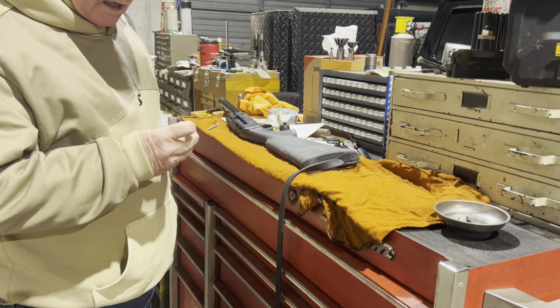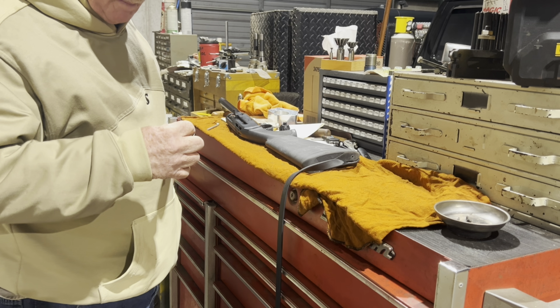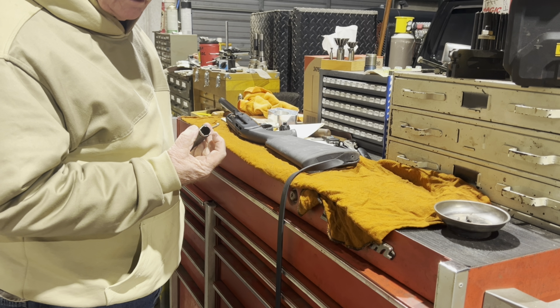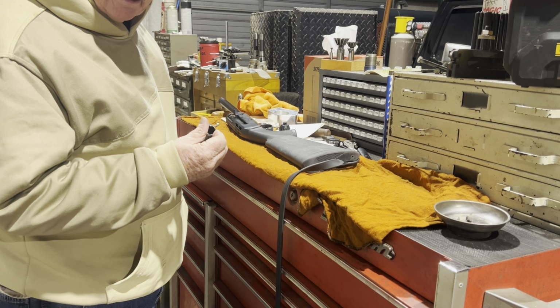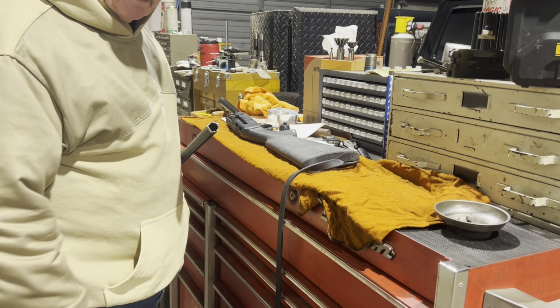I'm either gonna take a hacksaw and clip that a little bit, but I'm probably gonna end up taking a burr bit and reaching in there and thinning that thing out. My idea is then take a pair of vice grips, clamp it on the side, and make it collapse where I burred it thin, and see if we can't get it out from there.